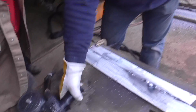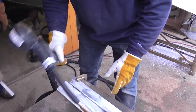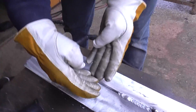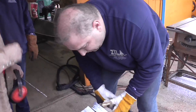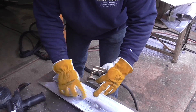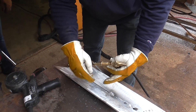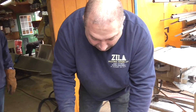So here Richard, when you were welding earlier with the spool gun — on the spool gun you can only adjust your wire feed rate, you cannot adjust your voltage. So you set it about where you want to be and then you weld. Typically what you want is an open V-joint — like here you have the open V-joint and the bottom is close together. What you were trying in the beginning was to weld this. You have a little gap here, but you don't really have a V-joint because this is really wide open. Therefore you have a relief on the back, so once you're a little bit too hot, you keyhole out — you burn right straight through just like here.